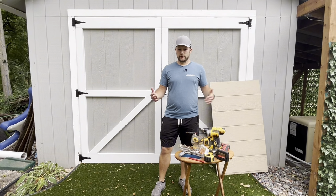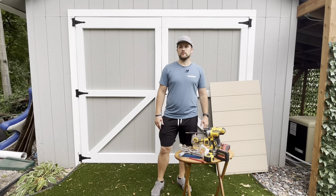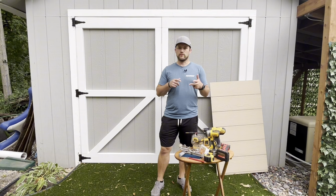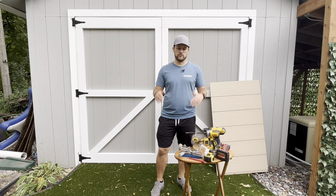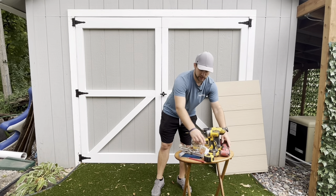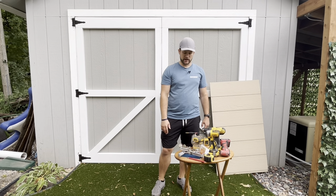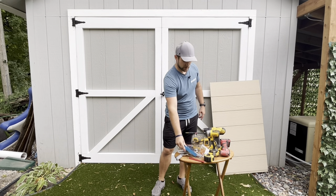This project involves cutting wood, basically cutting some paneling, so you do need some decent tools. I used a miter saw and a handheld skill saw with a Kreg track system. You don't need that — if you're decent with a skill saw, you can do it by hand without the track system. You'll also need drills, and for some of the finish work, an oscillating tool. Obviously you're going to need a tape measure, pencil, and some clamps for attaching the wood to the paneling.